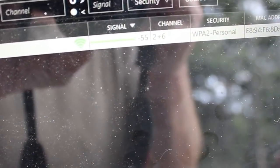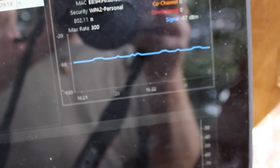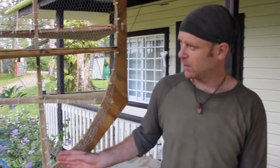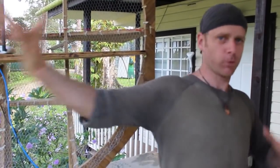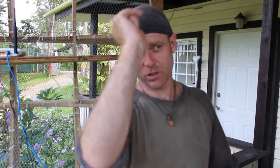We're getting about 57 decibels signal there, which is very good for hundreds of meters of trees. We're also picking up someone's phone — I don't know who that is, but they're a long way away. The connection is good enough to download Facebook pretty much as quickly as if you were in the house with the router. This is the dish up at the main house — it's got the router at the focus — and since it's at the back of the house, the signal broadcasts through the house normally but the other half gets spotlighted out towards the second house, which is about 300 meters away.